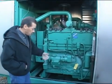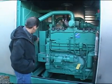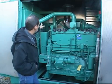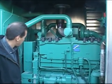Any loose debris that works its way into the housing will end up here because the airflow is across the engine and out the front. So you want to make sure that your grill is clear. You want to look at all your little sections of hose — make sure you don't see any leaks, any cracks or anything like that.